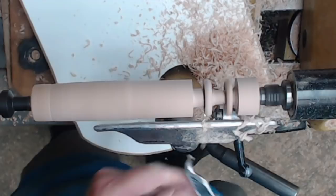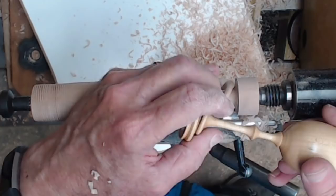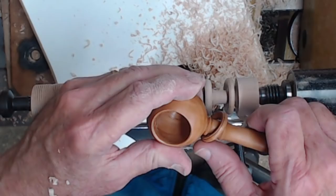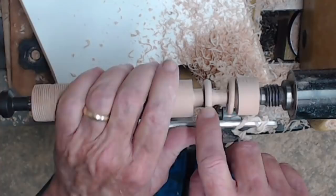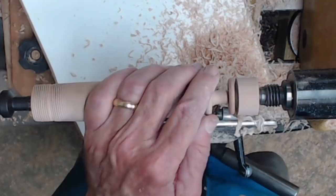At this point I think it's appropriate to tell you that for a lot of these projects — especially small beads like this — and certainly for ones that are going to get a lot of use, it is a great idea to go ahead and dribble a little thin CA on here and let it dry before you finish parting it off. Do that after you sand it, maybe touch it up a little bit after putting the CA on it. That will strengthen the fibers, reducing the chances of it cracking as you're getting it loose.